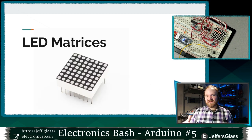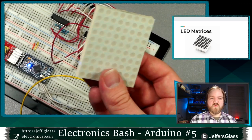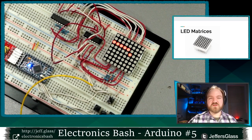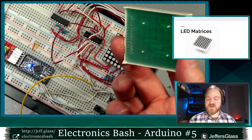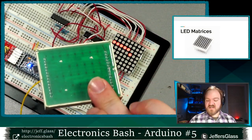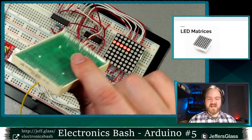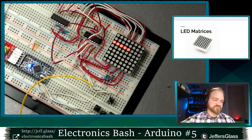Let's start by figuring out how we turn on these little 8x8 LED matrices. They essentially all work the same way. I'm going to be using this 8x8 one because that seems to be the most common size floating around in your kits. But if you have a differently sized one, the code we write today, with a couple of small modifications, and the hardware that we set up to drive it will work with just about any size of these displays. You might just need to do a little extra footwork to figure out what the actual connections are, because of course you will have more or fewer LEDs than I do here.